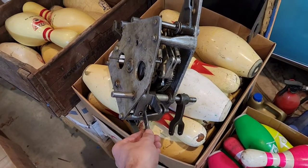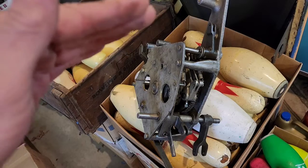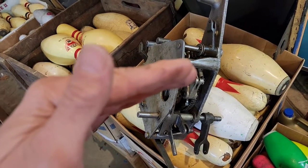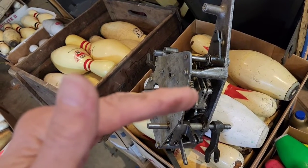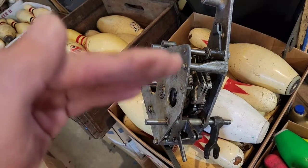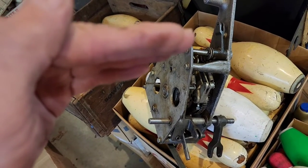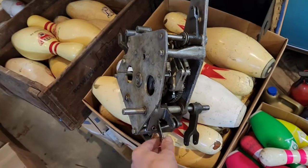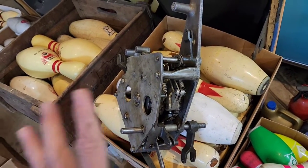If it detects standing pins, it says operate the scissors and do another short stroke, so the machine comes down on the short stroke and back up on the short stroke. There's a short stroke and a long stroke. The third option is an out-of-range, where the deck comes down even higher because it's landed on a standing pin, and the detector rod triggers an out-of-range cycle — it pulls the clutch and stops the machine.